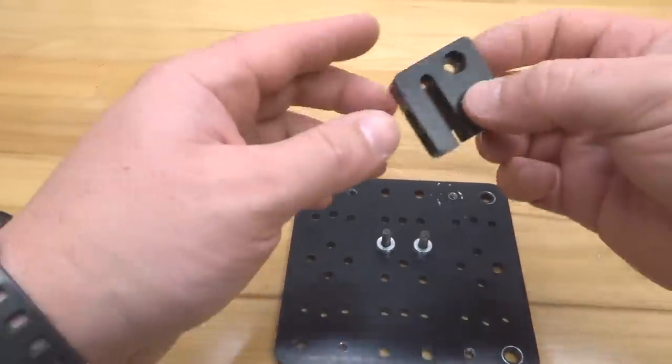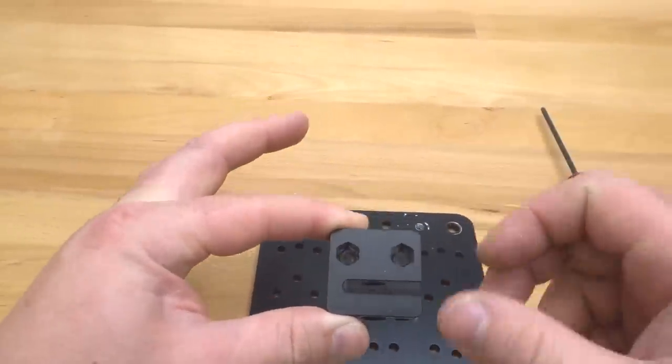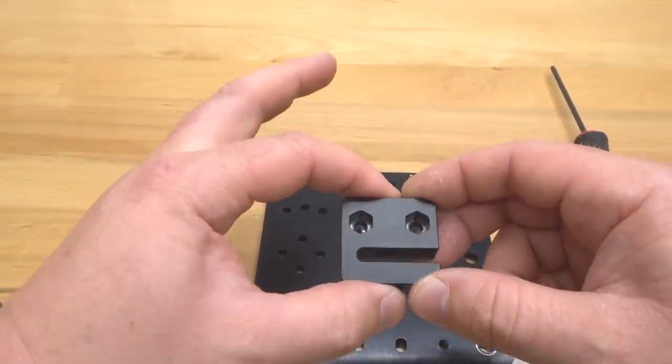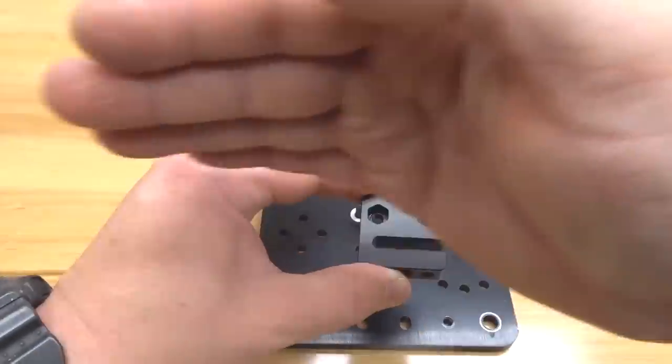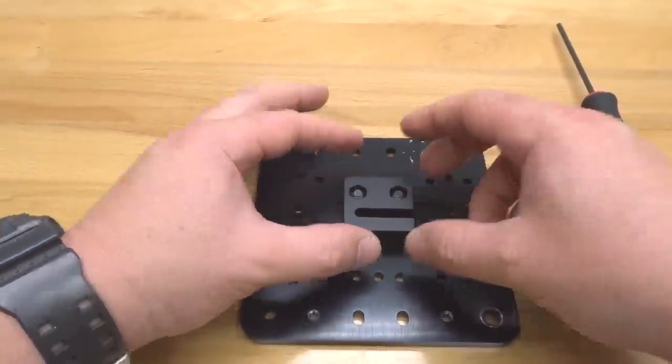And then we're going to go ahead and add our anti-backlash nut block, making sure that the hex side is facing you, and make sure that our threaded hole here for our lead screw is facing you as well. So the lead screw is basically going to go up and down. Our x-axis is going to go side to side, so make sure that you have that correct, guys, because otherwise we'll have an issue when mating the plates